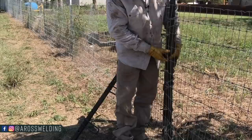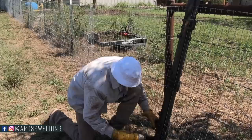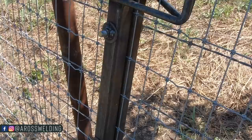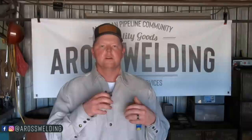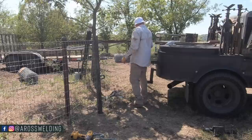This is the first time I'm using this little apparatus to stretch this wire. It's a real basic idea. An even simpler idea would be two 2x4s with holes drilled in them and bolts running through — which you'll see us use later in the video to stretch the five-foot no-climb versus the four-foot section we're about to stretch with this new hoodoo. One thing I like about building this stretching apparatus out of metal is I tacked the bolts on one side so I don't have to hold a wrench on the back side — I just use my impact gun to run the nuts on and off. A little quicker, but the 2x4 method works just as well, it just takes a little longer and it's handy to have an extra person.